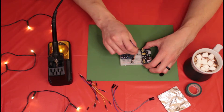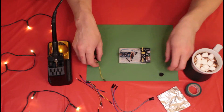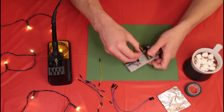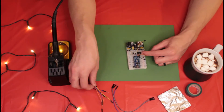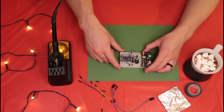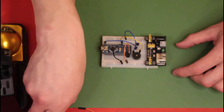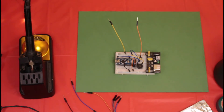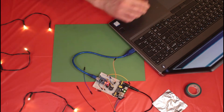This blue wire is going to go from the emitter pin to the D2 pin, which is the input pin on the Arduino. Then I'm hooking up the buzzer — one wire on the buzzer is going to the negative rail and one wire is going to the output pin on the Arduino. That yellow wire is going to the D12 pin on the Arduino and the blue wire is going to the negative rail. Finally, I can hook up the sensor wires — orange goes to the base pin of the transistor and yellow goes to the positive rail on the breadboard.